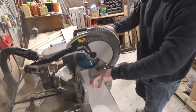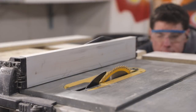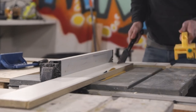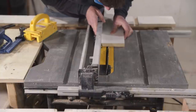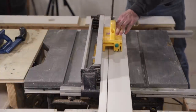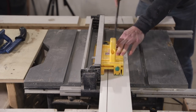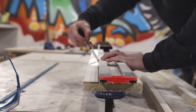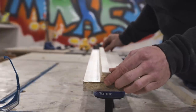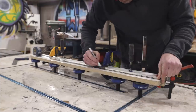To make this epoxy cube I'm going to be pouring epoxy resin into a melamine form. The form is simply a box that's going to have a strip of melamine around its inside that's going to create the channel for the LEDs in the epoxy cube. Here I'm cutting this strip for the LED channel with a draft angle on each side, and that draft angle is going to make it easier to remove from the epoxy after we pour.